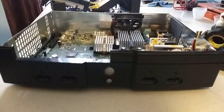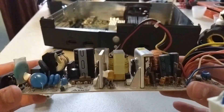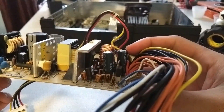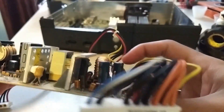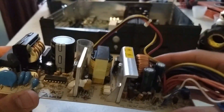Generally speaking, if you're having power issues with your device you should probably check the power supply first, so I'm going to take that out and give it a good look. Here's our power supply. The first thing I would check is on top of the board — check the capacitors. These are the objects here. Check if any of them are an interesting shape or have discoloration at the top. See how the tops are completely flat? That indicates they're probably in good health.